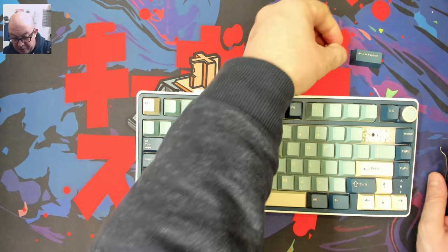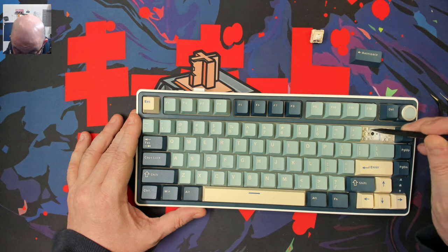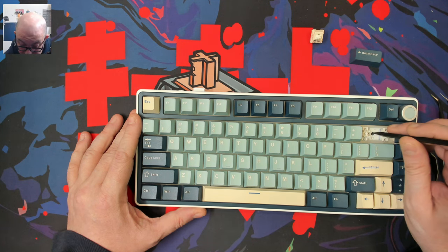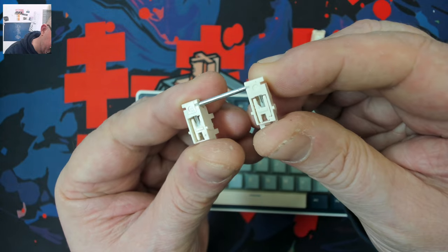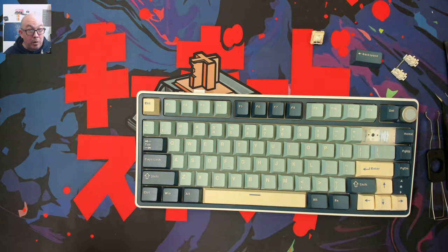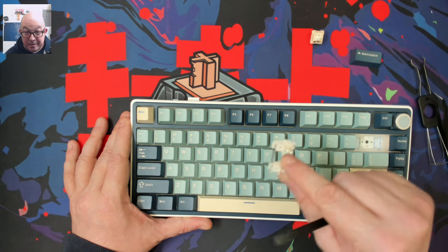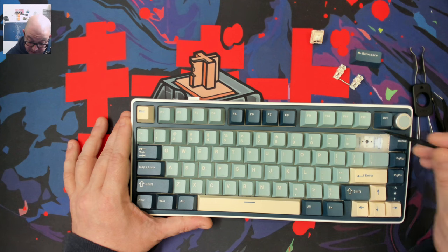All right, let's pop this chartreuse out here. Taking a quick look at the PCB, we do have the hi-fi layers with the PET plastic above the PCB and the IXPE above that with the center hole already punched out. And it does feel like we have maybe a neoprene below the PCB. We do have plate-mounted stabilizers. As we can see, we do have lubrication both inside of the stem and on the elbows, with the spots more where most of the contact is going to happen between the wire and the stabilizer. Peeking down inside, it does not look like we have the ability for screw-in stabilizers. Thankfully, the newer ones I've come across so far really have good tolerances with the plate, so I haven't come across any issues with ticking as of yet.